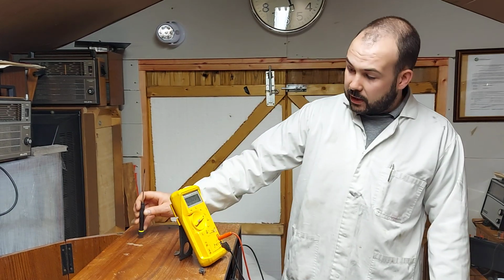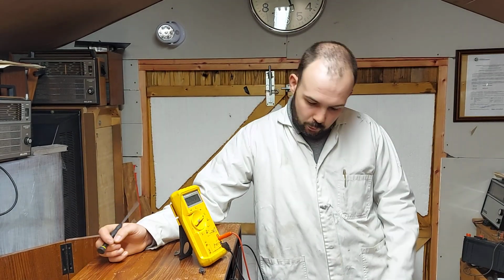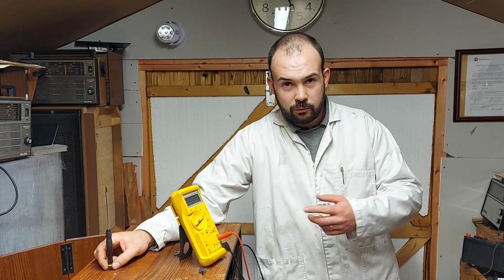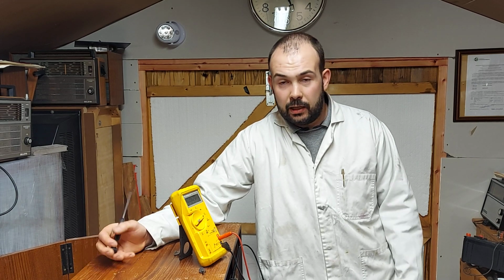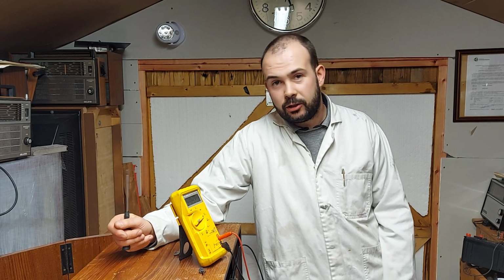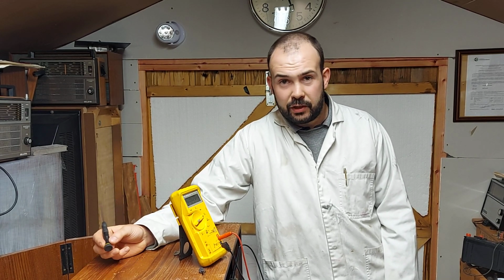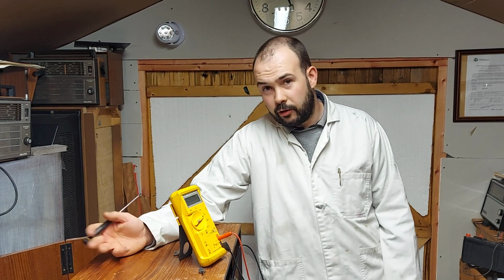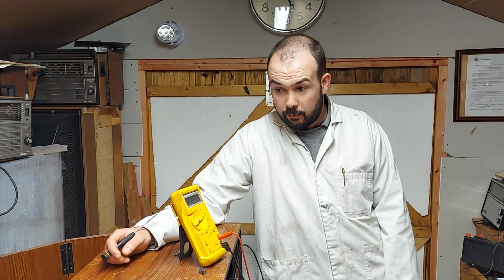So for the last, let's see, this is Thursday, so for 3-4 days, Monday I put the power supply on the line output transformer to dry out the overwind. I've talked about that before in previous videos, to drive out the dampness that accumulates inside the windings in the line output transformer over, you know, 40, 50 years. This wouldn't be so much of a problem when the TV is in service, but when they're lying up for maybe 20 or 30 or 40 years in a shed, which this one probably has been,